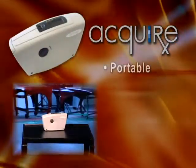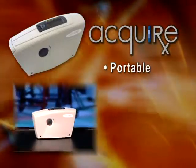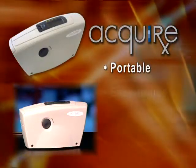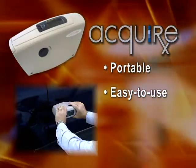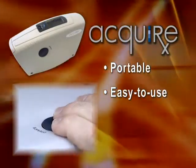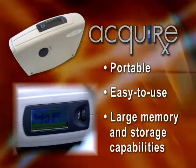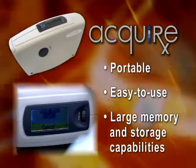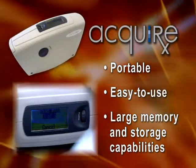The Acquire RX is portable and can be used with AA batteries, so battery replacement is easy and the unit can be used anywhere. It's easy to use. Simply press the spectrophotometer against the polished finish and press a button to take a reading. And with large memory and storage capabilities, it can hold up to 999 readings in memory, so you can take readings from several vehicles before download is required.